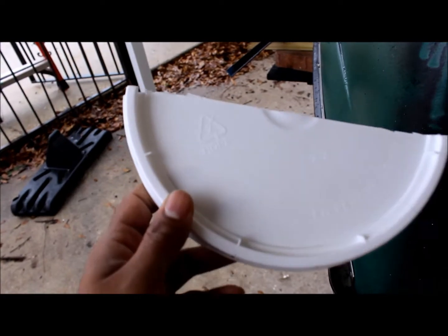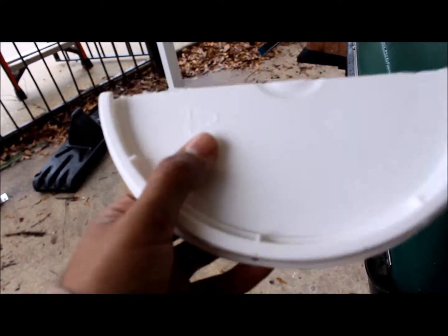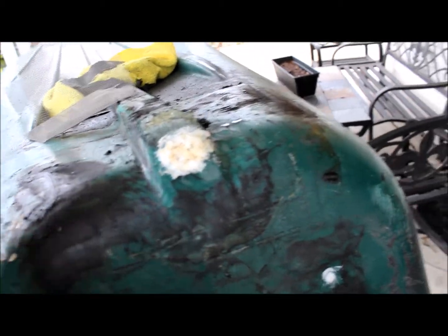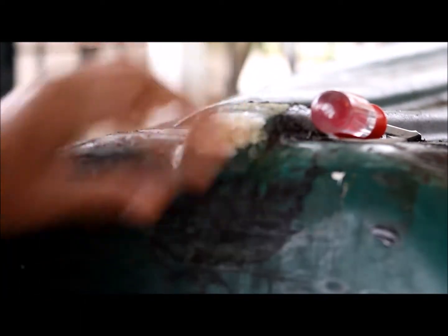This is what I use here. It's hard to see, but right here it's an HDPE recycle triangle with the number 2 — that's what you have to use for my canoe. So we're going to put the wire mesh on. Get a screwdriver, wire mesh, and a heat gun. Heat up the area where we're going to keep the wire mesh before we use our plastic welder.